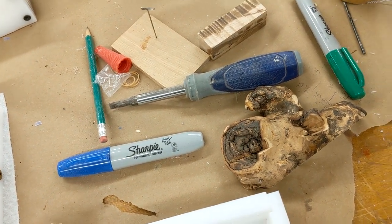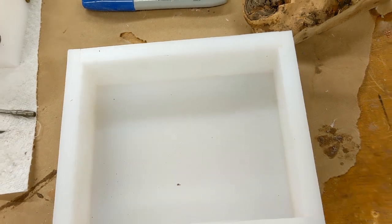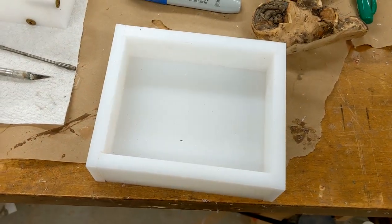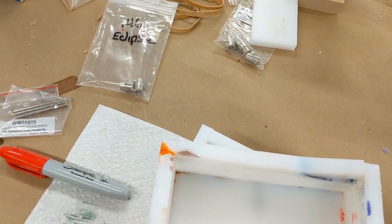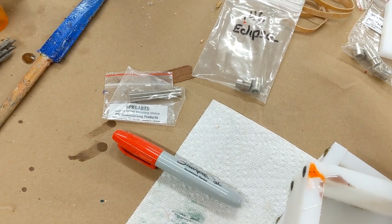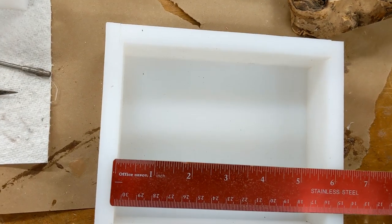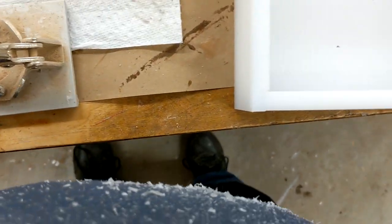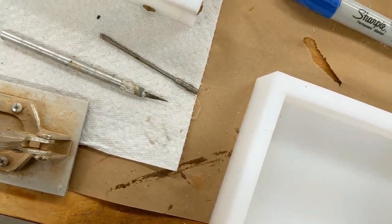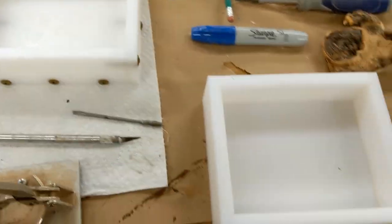and then having the rabbet along the side piece, now I can pour my Alumilite and have less leakage in my pressure pot. The original piece measured 5 5/8 by 4 3/4, and with the new setup, 5 3/4 there and 4 3/4 there. So now I can pour my pen blanks, and once I trim them to size, then I'll get a better blank.